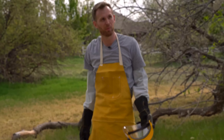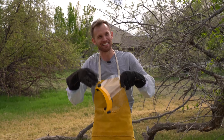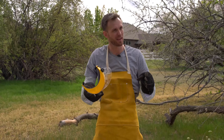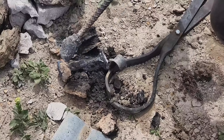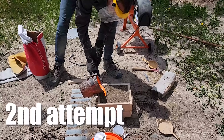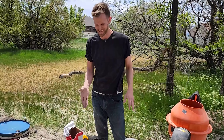I have no idea what kind of result we're going to get, but we poured cast iron. I might have half a frying pan in there. There's a very fair chance that when I set that down some of the sand collapsed. Maybe I've just got a handle — I kind of aimed it at the corner where the handle meets the pan, so maybe I have a little bit of handle and a little bit of pan. I don't feel like that was the super thin, flowing, rushing liquid we wanted going into that mold. I am guessing, at best, half a frying pan.